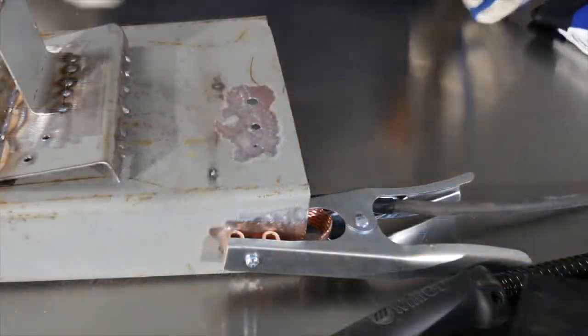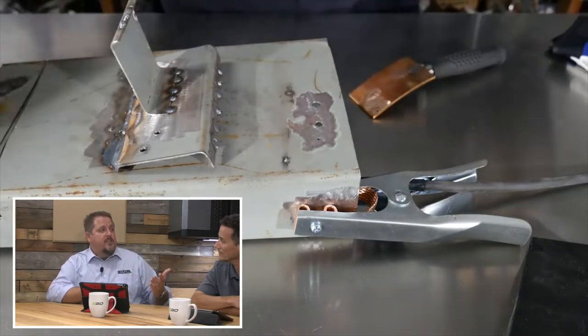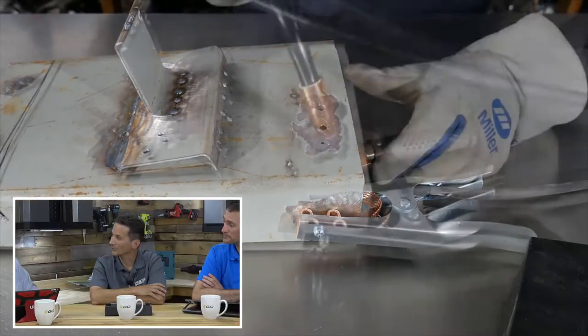Getting into metals and a tool tip: if you've ever tried welding and you've got holes that have been drilled in sheet metal, or maybe you need to weld two panels together and there are holes in them that you need to fill — when you feed a welder through a hole you don't get any contact and nothing's going to stick. So you use what they call a copper spoon, which you can literally use a real copper spoon, or you can buy these at hardware stores or welding supply stores.